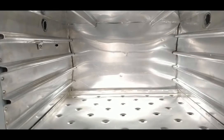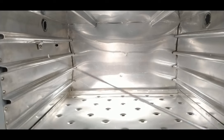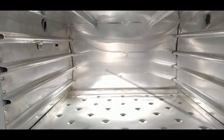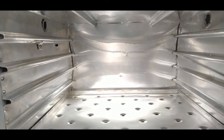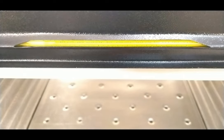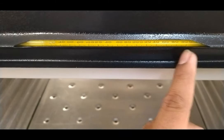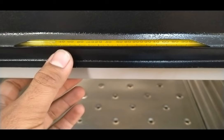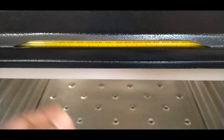Let's have a closer look inside the oven. Here is the thermocouple installed inside to check the temperature within the compartment. There are also two outlets for air circulation inside, so some amount of air will continuously pass through for proper heating output. The heaters are installed on both sides. The walls are insulated with double-mounted construction. There is also a conventional thermometer provided for 0 to 300 degrees centigrade, and right now the mercury level is showing about 30 degrees, which is around the current ambient temperature.